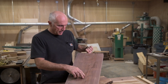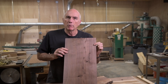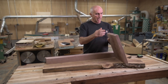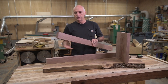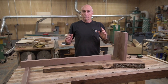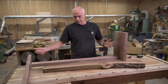I still have some cracks in it. I'm going to use some epoxy on that to fill the cracks and the knots. I've got those pieces milled up. I cut this to length — it's 16 inches. And I milled these to inch and a half by three inches. I'm not sure I need this one piece down here, so I'm not sold on it yet. I could flip it so you don't really see it.